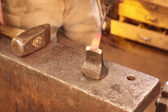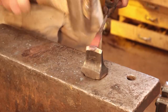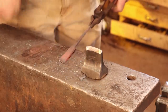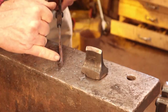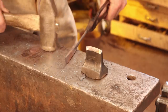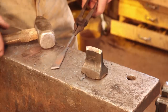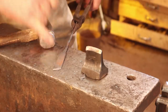We do it all from one side — careful, don't go all the way through into your hardy. What that does is create our bevel as well as the slope or the angle that I like on these knives. This angle I don't think is real critical. The bevel, when I grind them, I usually go to about 30 degrees. But I don't think this slope matters so much — it's just to get a good sharp point down here.